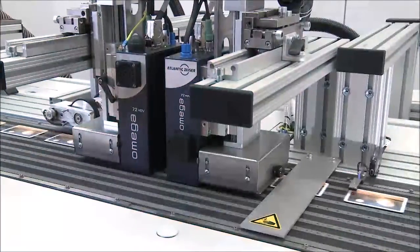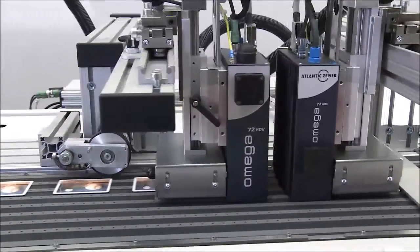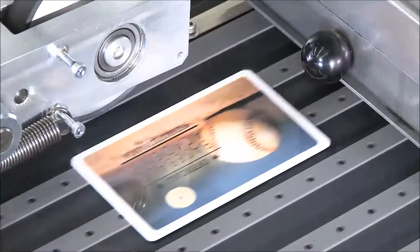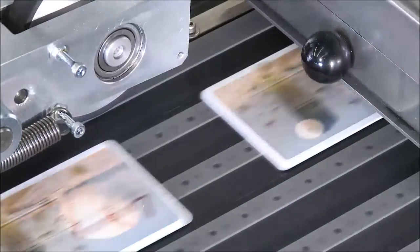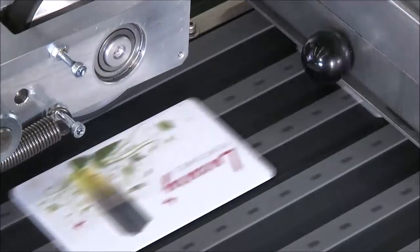Also available is UV coating and curing, another Cardline Versa Color Plus innovation. This is a value-added step in the process that provides a glossy, finished look. A transparent coating can be laid down edge to edge or used selectively to enhance or embellish spots.